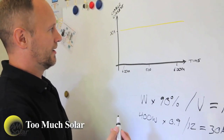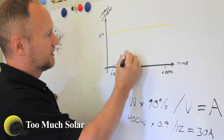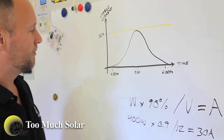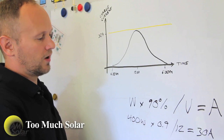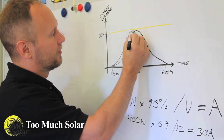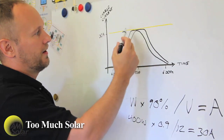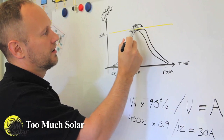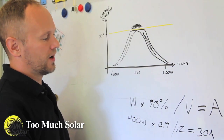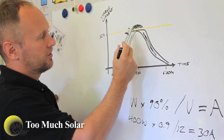With four 100-watt solar panels, your current versus hours in the day is going to have a curve that peaks around noon and goes down as the sun goes down, from about 6 a.m. to 6 p.m. If you put more wattage — say 500 watts — on the charge controller, you'll get a curve that's a little bit fatter and levels off right at 30 amps before going down. In most cases, it's not going to damage the charge controller to have a little extra. You just won't be able to take advantage of the very peak, but you get the benefit of the wider curve. Oversizing your solar array relative to your charge controller isn't necessarily a bad deal.